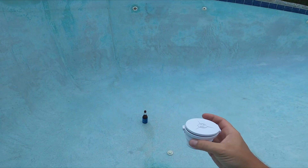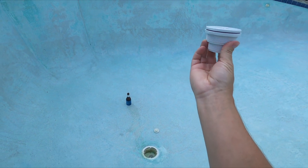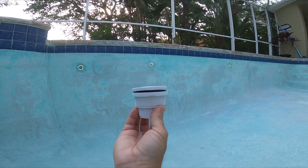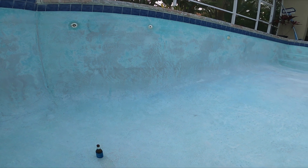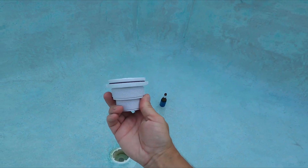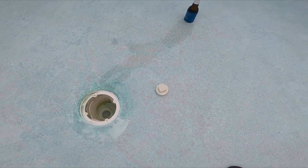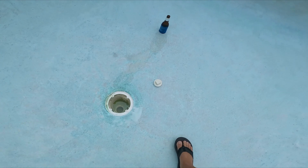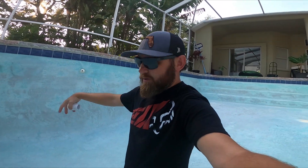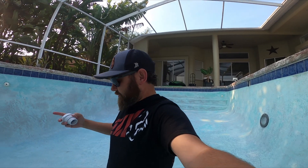You're seeing it work right here. The way this works is it sits at the bottom of the pool, and the head pressure from the pool is keeping it closed. And on the other side — the outside of the pool — if the pressure on the outside of the pool is higher than the inside, it pops open and allows the water from below the pool to go into the pool and neutralize itself. This is what you want to see at the bottom of your pool. That is what you don't really want to see. But if you do see it, try to take it out as high as possible when you're draining your pool. If you don't see either of these things, there's a chance you have some sort of bilge pipe where you can shove a sump pump and pump out the water from outside of your pool.